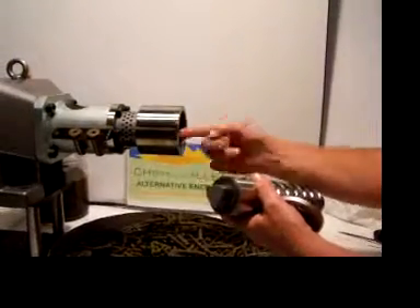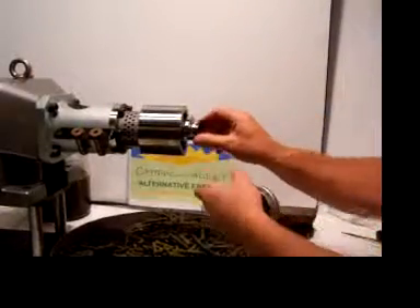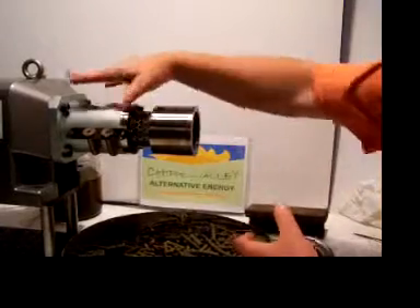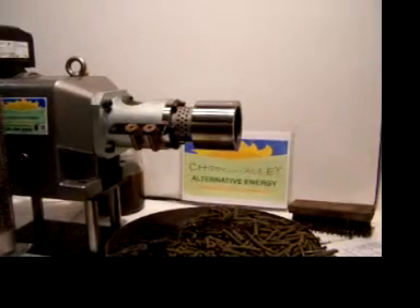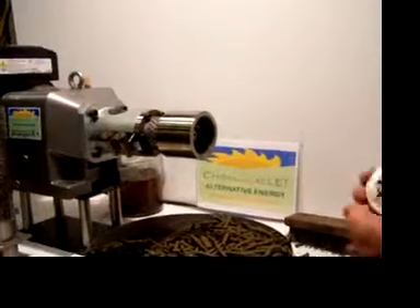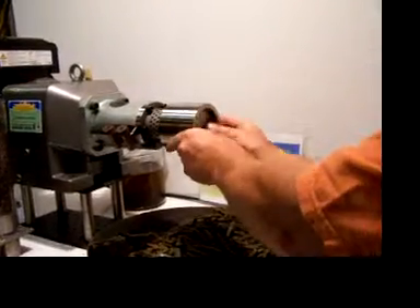I want to clean material out of this area. I will use a shop vac — actually I can slide this in and rotate it. It goes in the rest of the way; now it's engaged into the gearbox. I'm going to suck out any seed. This is the crush plate, this is ready to go in — now we'll set the correct crush plate back in.